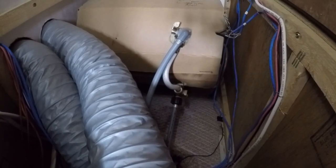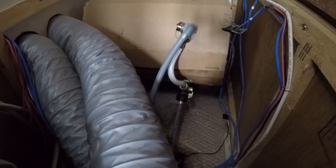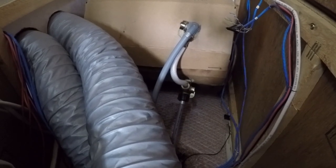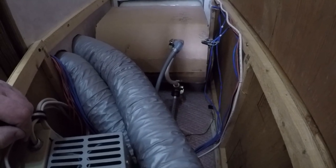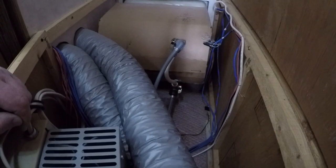We've got the cold water line low point turned off, the hot water line is still turned on. Reading my instructions to go out of bypass, we want to turn this knob this way and this one that way. We can hear the hot water tank starting to fill. The reason we leave the hot water drain point open is that the air in the hot water tank is being purged out through that low point drain. Once the noise the water heater is making changes, I'll reach down and close off the low point for the hot water line, then we'll repeat purging the sinks.